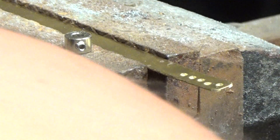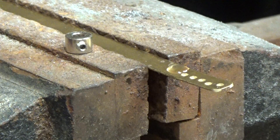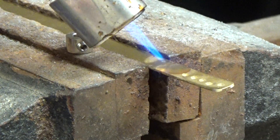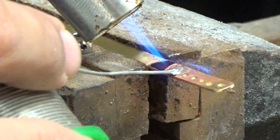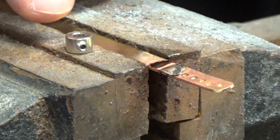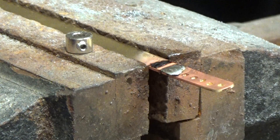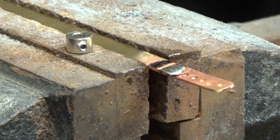Now we're going to get to the soldering part. I'm going to put a little drop of liquid flux right there and pre-tin the brass, just so it ends up being one less thing I need to hold onto. Put a nice solid bead of silver solder in there. Now, when we get to this wheel collar, there's a stainless steel set screw in there — the solder will not stick to that, so if you end up missing when you're soldering you won't get any in that hole. I certainly recommend that.